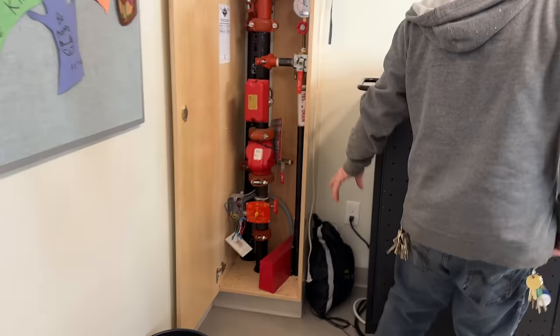So the first technician that was working on site didn't plug in the rear XP6 CA card, and the technician that's on site now didn't know that, so that's why some areas weren't running. Now the second card got plugged in, and what you're going to see is what happens when the full system's running and it is drawing too much power for the panel's power supply and keeps tripping out on overload.